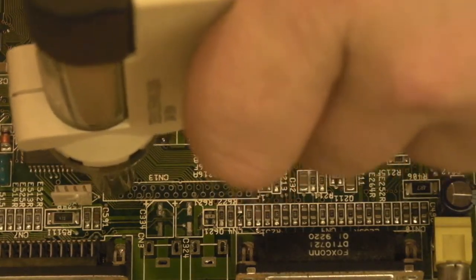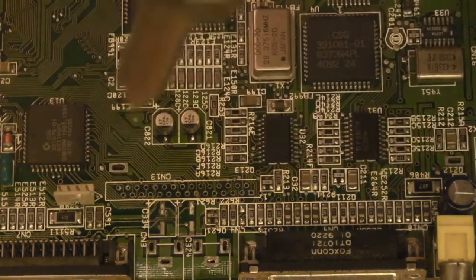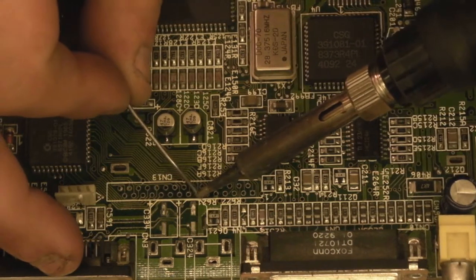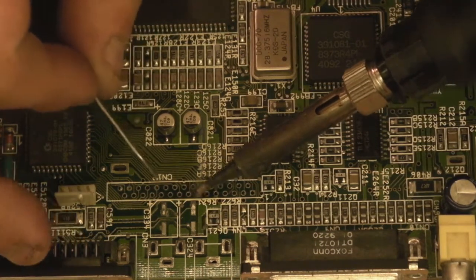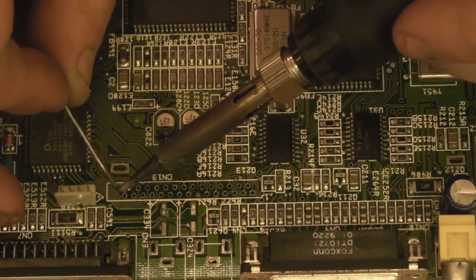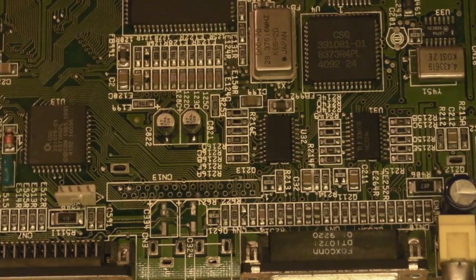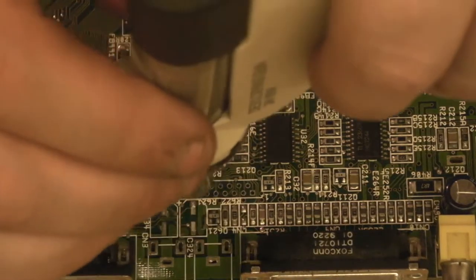That's not desoldering, I'm going to add some nice fresh solder to them, and then we'll have another quick wick at them. We've obviously got some solder there which doesn't want to flow. We've got one there, and we've got a couple here. And I think all the rest are clear, it's just them three. Like I said, they've been affected a bit by that old nasty solder, so we'd rather get everything out of there.